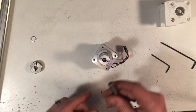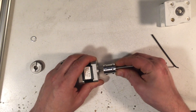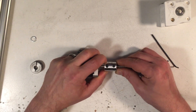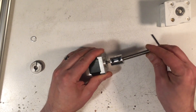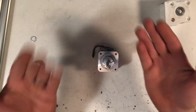Let me put the shaft in here and show you what we're talking about. Now instead of squashing the flexible coupler, the entire weight is resting on that bearing — I can't compress it. And if you have a lead screw that's slightly off kilter, you're still going to be able to move around because it'll pivot on that ball bearing and still carry the weight. So there you go.